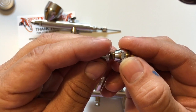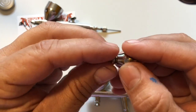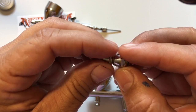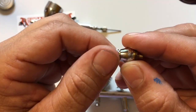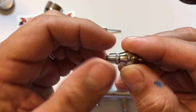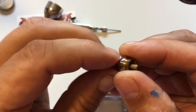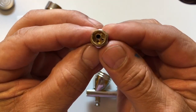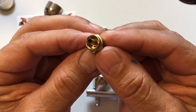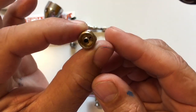Replacement parts are available. Notably, the precision on these threads. There's no rough grading. It's extraordinarily high spec tolerance, and it seems to come with some type of heat-proof grease on this. I was shocked to not see any chrome plating on the inside, although that doesn't affect anything. And it does split down into a 3-hole assembly, which should provide good atomization.